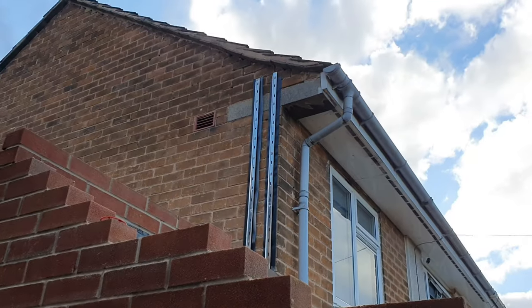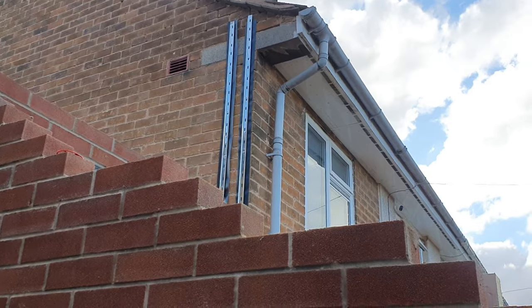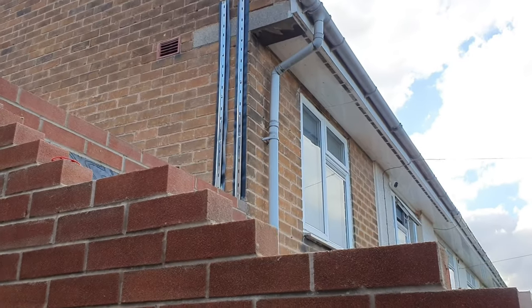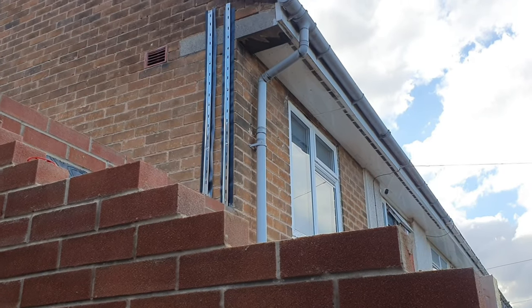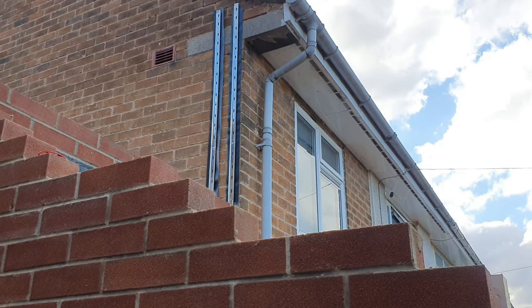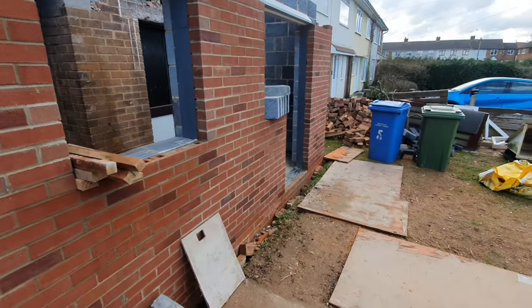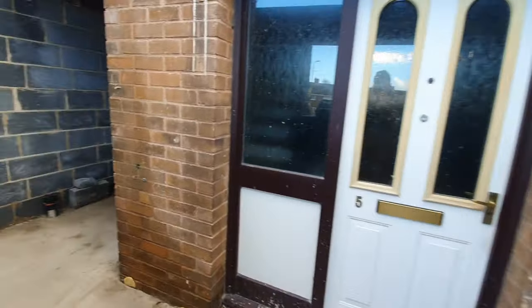We've got starter strips on the wall up there, because a lot of that wall's going to be removed. Downstairs, we haven't cut for a vertical damp in that wall because it would weaken the structure. So the building control guy is happy for us to just do the vertical damps like that. So zoom back out a little bit again. Nothing's really changed on the front. We're up to that level on the last video, I think.